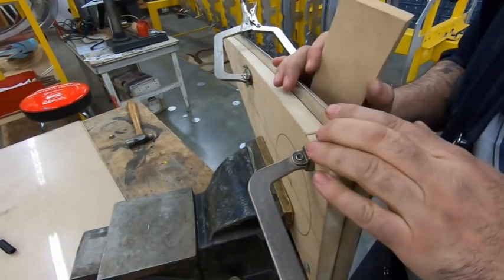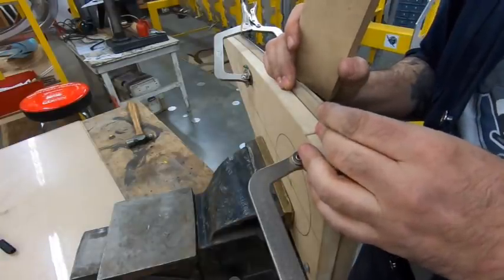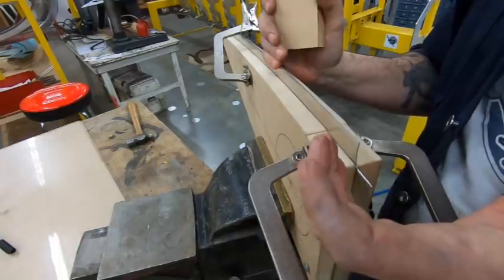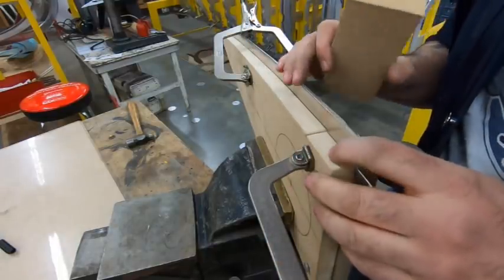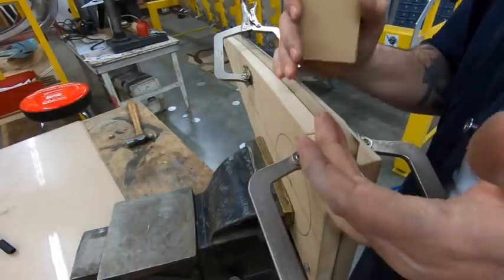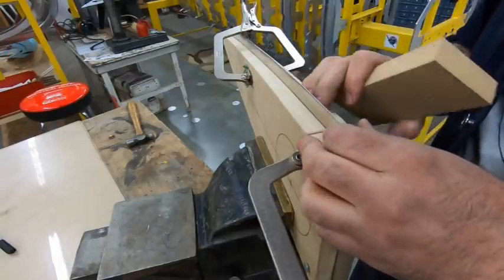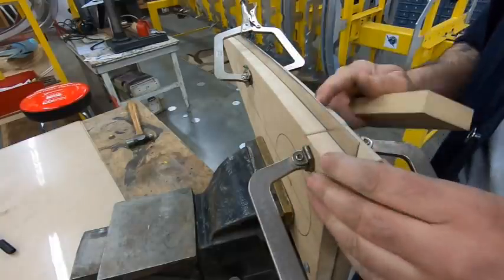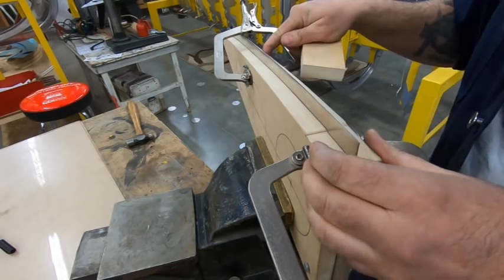I'm going to do something a little bit different with this one. In past episodes, you've seen me using the rivet gun and doing forming that way — it works a lot better for tight curves and thicker material. However, this is 32 thou and it's an O condition, so it would get damaged really easily with very little pressure from the rivet gun itself. That combined with the fact that it's such a gentle curve being formed over, and the very small radius on the form block.